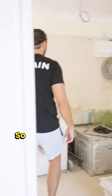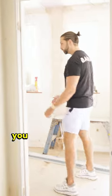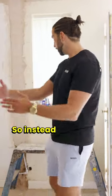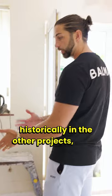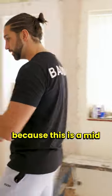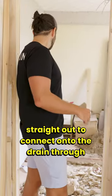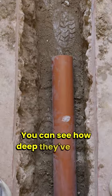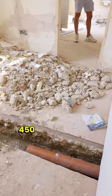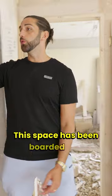Not a lot has changed through here, but as you come through you can see the guys have gone straight out with the drains. Instead of coming across to the external wall like we've done on other projects - because those are semis - this is a mid-terrace so they've gone straight out to connect onto the drain through the rear. You can see how deep they've gone, probably about 450mm down into the ground.